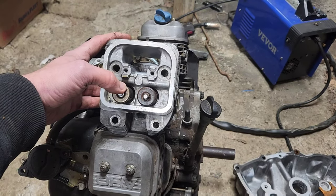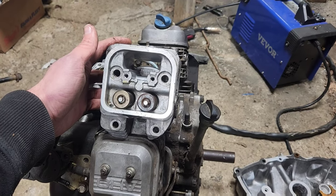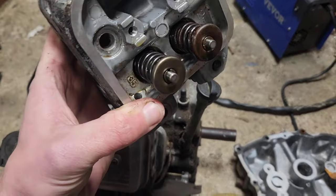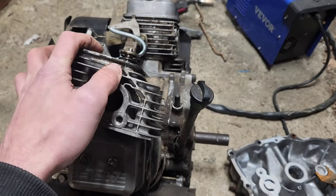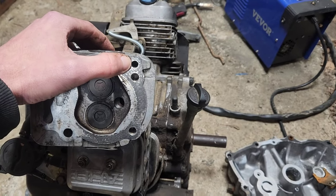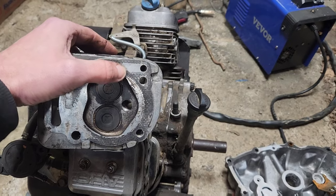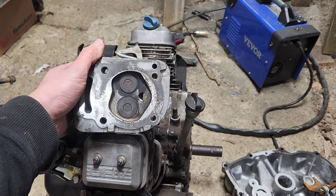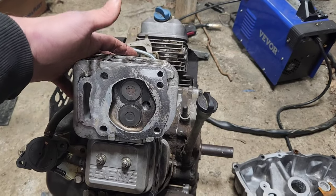Using this head as an example because it's very close to the same design as the Predator head — if I hold it this way and my oil is coming in through here, where does the oil go? It goes through this little itty-bitty return hole, right down in there, casted in, following that line all the way down through — and there's your oil return right there. Why the gasket fill is so giant when the hole can only be in one spot, I'm not sure — if somebody knows more about Vanguards, please comment below.